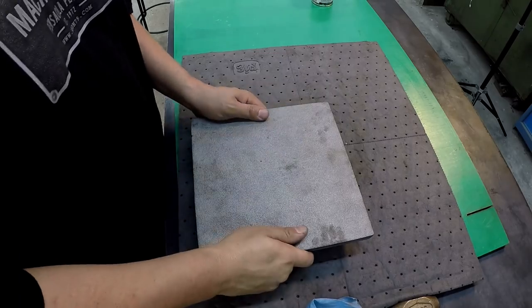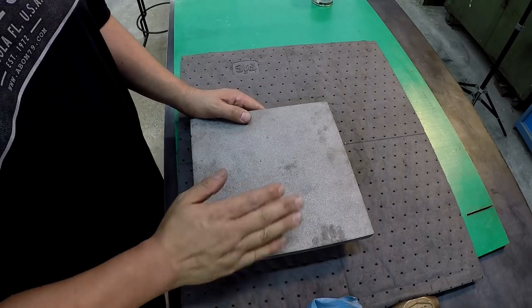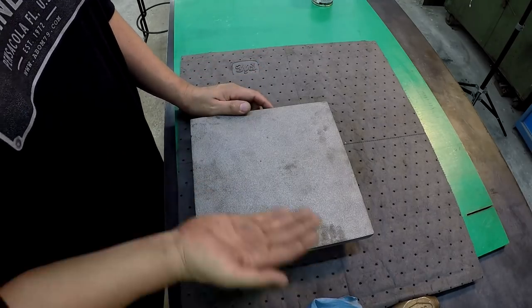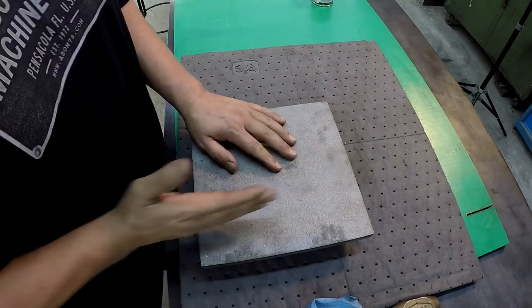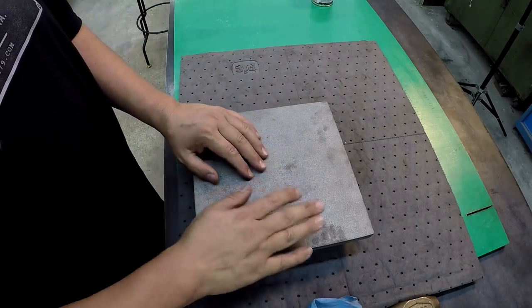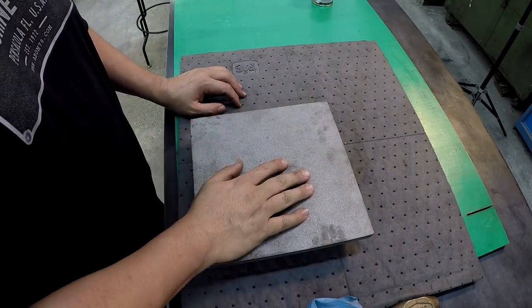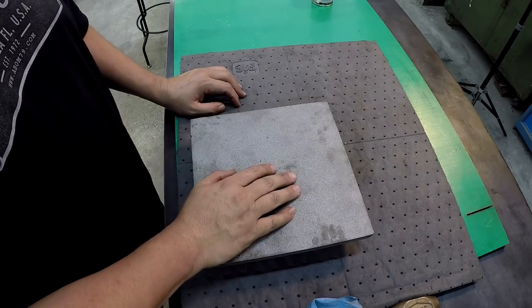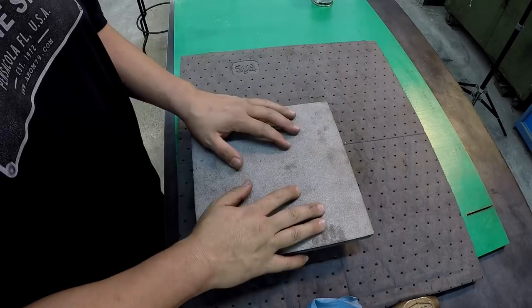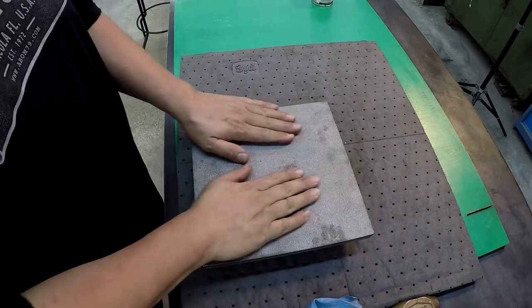Once we have this in the vise, I can take, say, a long piece of flat bar or some kind of workpiece like that and just slide it up against the pins, and I know that it's square, and then use the hold-downs. So that's going to be some more, but actually I'm kind of getting ahead of myself. I'm not going to be drilling and tapping on the next video. The next one is going to be surfacing this.